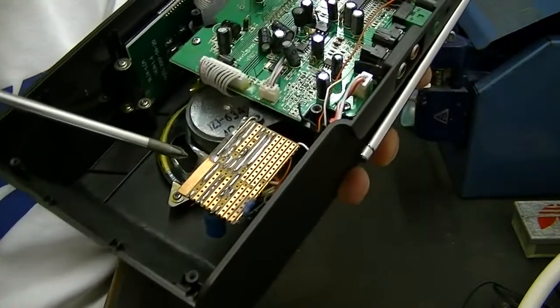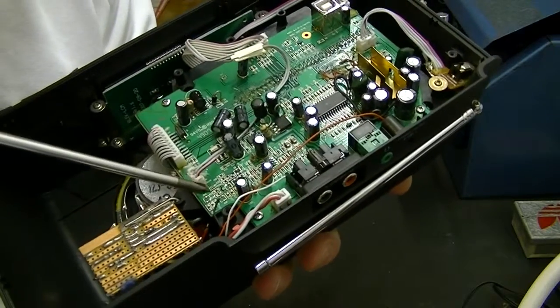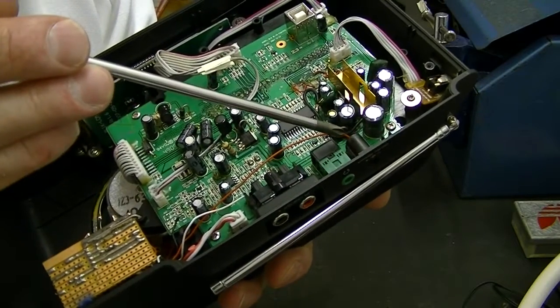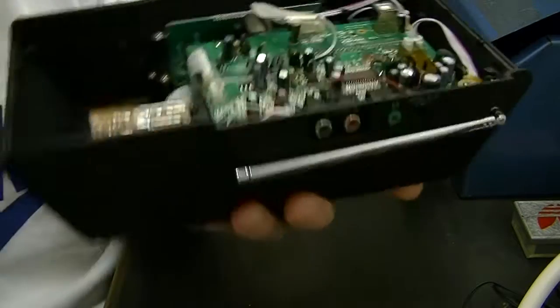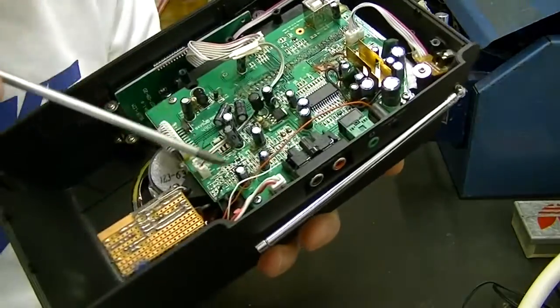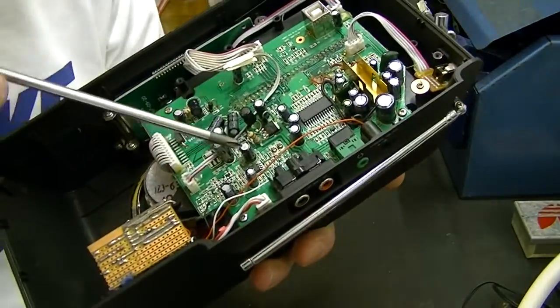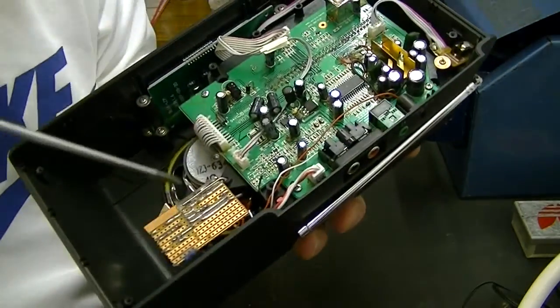This is obviously the transmitter that I've built in here. I've just hooked it in as a ground wire. It takes 9 volts from the DC input and it just taps off one audio wire from the left hand channel. So obviously that's what we're going to remove.